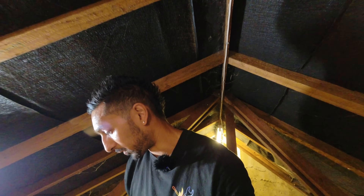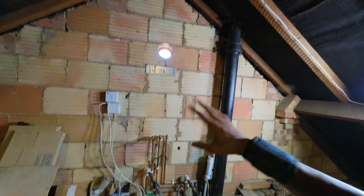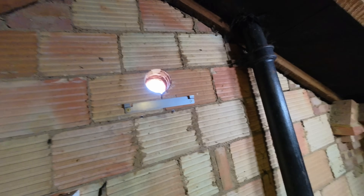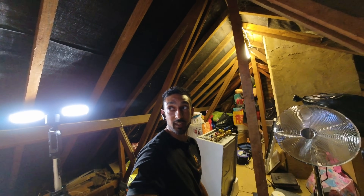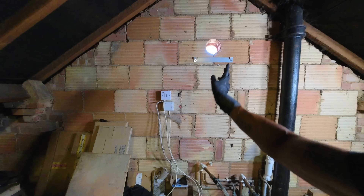I'm going to pop the camera back down, bring up the template for the new boiler, cut all that back, set you guys up on a time-lapse and start making some progress. Brackets are on — we had a bit of a tough time getting good fixes, but there are good fixings on there now. To the eye it doesn't look level, but that is level — the spirit level confirms it.